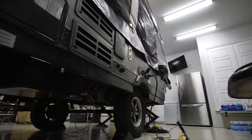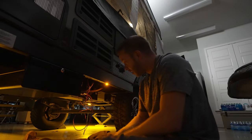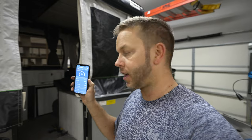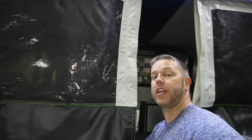Let's turn the lights off — it works! Just to do a comparison: awning light versus underbelly light. Nothing is running in my camper right now and it's drawing four watts — that's the radio and carbon monoxide sensor, which is why people's batteries die without realizing it. The awning light does 36 watts, minus four, so about 32 watts. The underbelly lights do 16 minus four — 12 watts. That's roughly 20 watts saved on average by using the underbelly lights instead of the awning light.